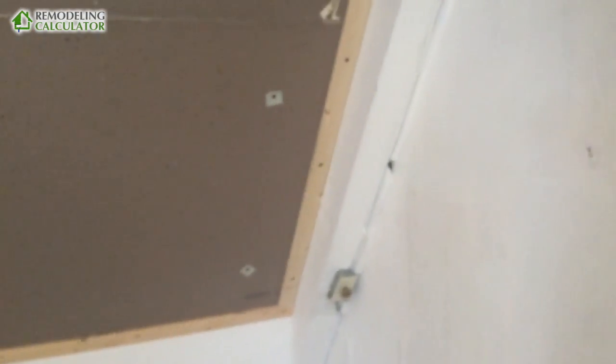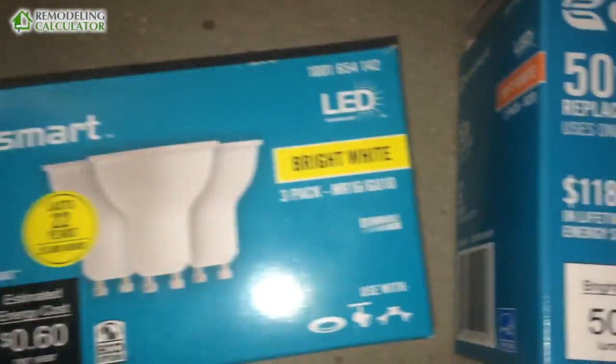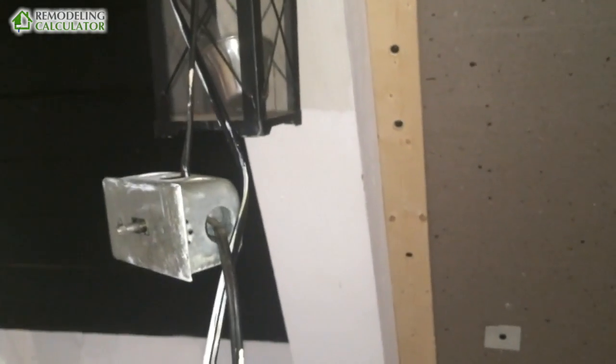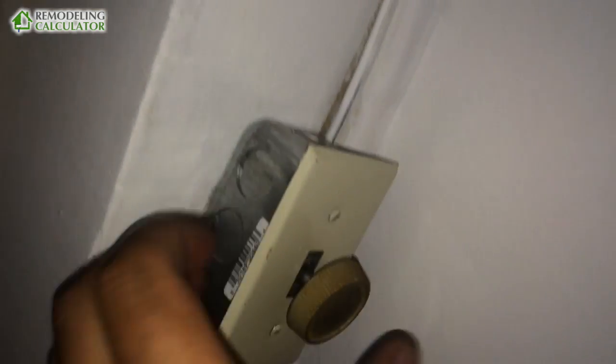So what causes the buzzing noise? It's your old dimming switch. Let's look at the light bulbs again — they're all dimmable, you can see right there, right there, and right there. All dimmable. So if you use an old switch like this, most likely it's incompatible with LEDs, and it's going to cause that buzzing noise. Those lights up there are connected to this dimming switch, but I think the dimming part in it is broken. For some reason, they're not making buzzing noise.